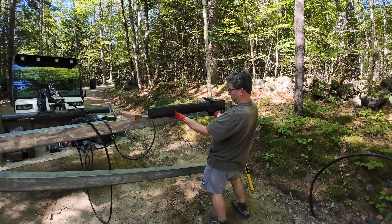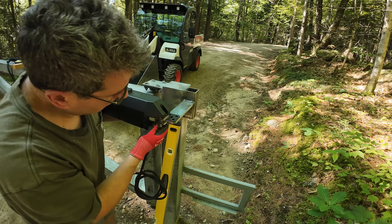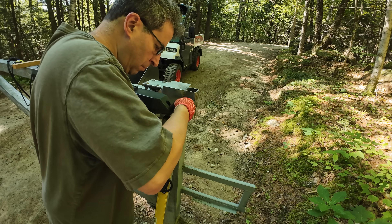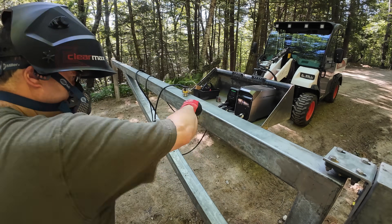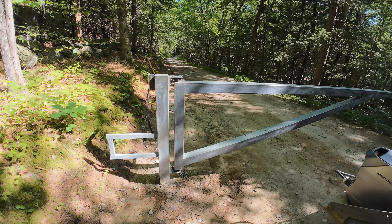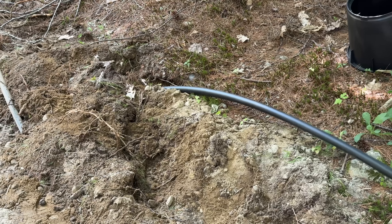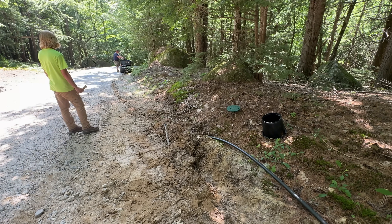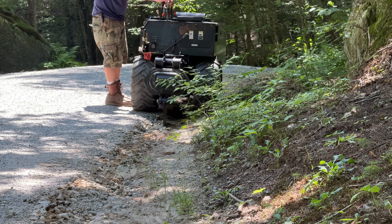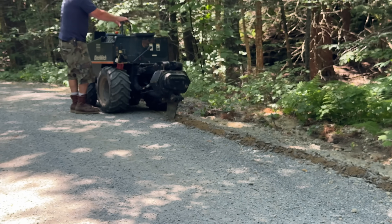The LiftMaster kit includes brackets that need to be welded in position. That little breathing mask under my welding helmet isn't for dust — it's to protect against fumes, because when you weld galvanized metal it emits toxic fumes, and that mask is specifically designed to eliminate that problem. Because I'm not using solar, I need electricity for this gate, and as I mentioned I'm running it on power over ethernet. This gate is a thousand feet away from my workshop, the closest connection point, and running a conduit would have cost about $27,000 — one electrician said I needed two conduits, one for 120-volt power and one for data. Instead I spent around $1,500.